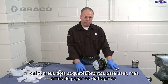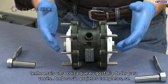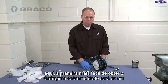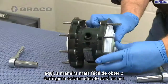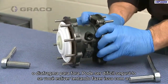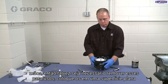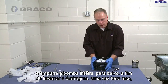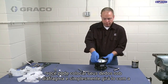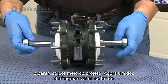I have my two sockets ready, but before taking the diaphragms off, one more thing to review: these are bolt-through designs. If this is an overmold diaphragm, there are not going to be these bolts. The easiest way to remove an overmold diaphragm is to apply even pressure from one side and push the diaphragm out. It may be hard by hand, so you might need to remove these bolts, place it on a flat surface, and push the whole pump down to lift the diaphragm up. Once that's done, get your fingers underneath and simply spin it off by hand. That's a tip on the overmold diaphragm.